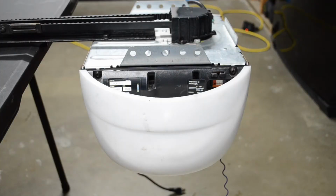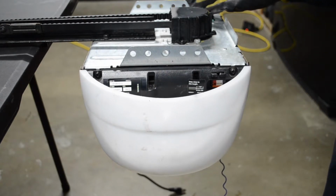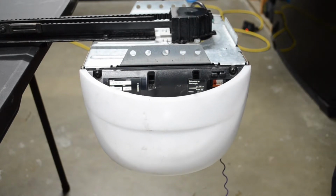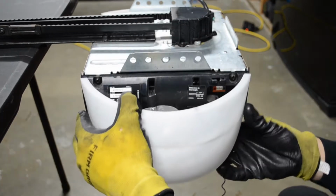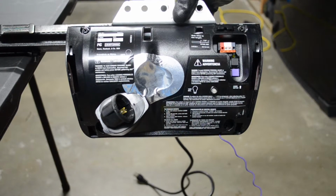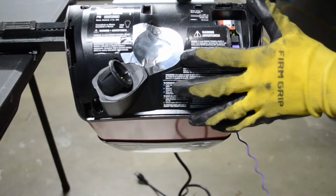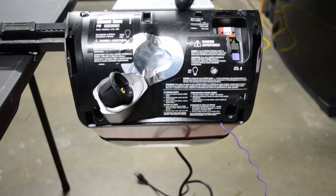Before you begin on a repair like this, especially anytime you're dealing with anything inside the unit, you always want to unplug it from the socket, which obviously mine's not even mounted, so it's already unplugged. Unplug your unit before doing this repair. Next step, open the light bulb cover here. So that's what your circuit board looks like, and I will link this down in the description below. You'll have this whole panel is what you'll be buying, and that's what you'll be replacing as far as changing out this circuit board on this type of unit goes.